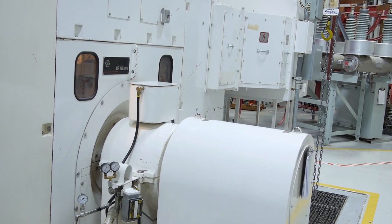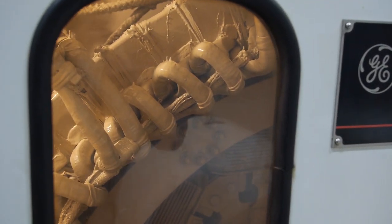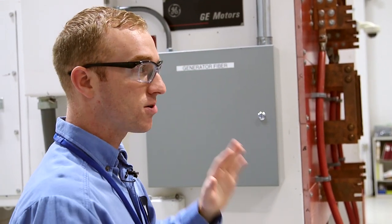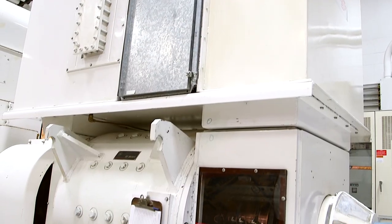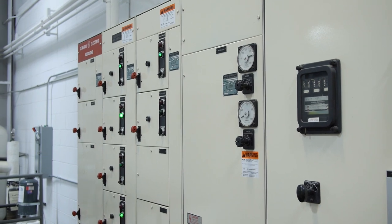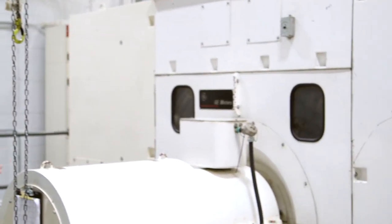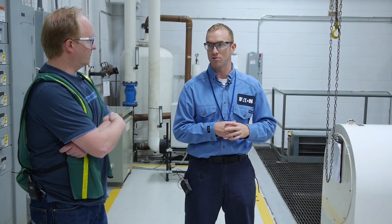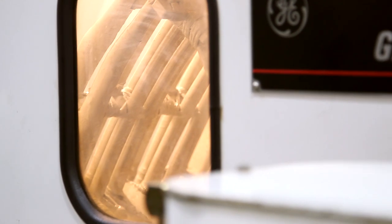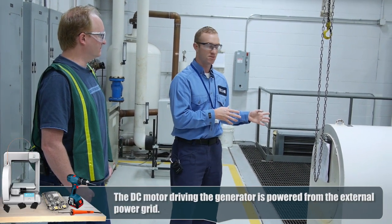We're getting pretty close to the generator now. Here's our generator output — 9 kV if we're at 100% excitation on one side, 15.5 kV on the other. The generator has two output coils and we can put them in parallel or series based on whether we need more current or more voltage. This is a stored energy system — it achieves 37.5 MVA continuous, driven by only a 1500-horsepower motor. It takes about 10 minutes to get up to speed and then the inertia of that 32-ton rotor is really how we get that output. This end is the brushless DC exciter, scaling from 0 to 100% excitation, corresponding to 0 to 9 kV.